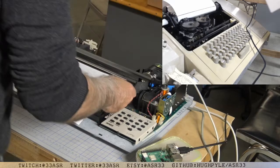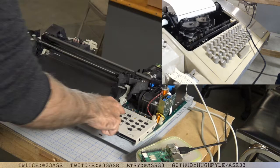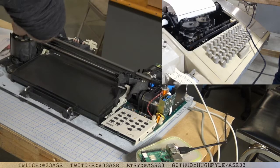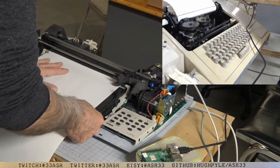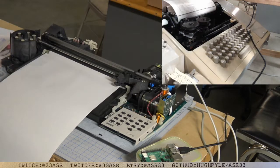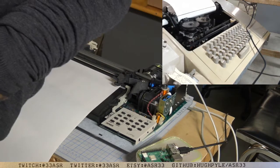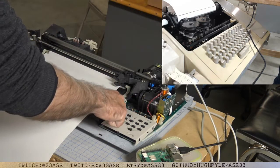Okay. So now that I know the way I want things to come out, I do pen one. Yep. Turn it off. Turn it on again. It says error already. I do not know why. Let's set the paper up. Load the paper down. Oh, turn it off again. There's a physical dip switch for which type of paper I'm using. I'm going to flip it to say A3. Well, that's US size, so whatever the US equivalent of A3 is. Size B paper. Right. Pen one.